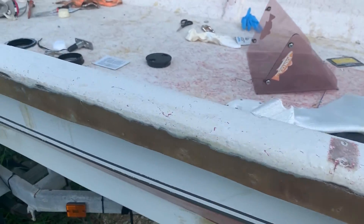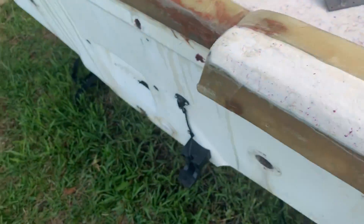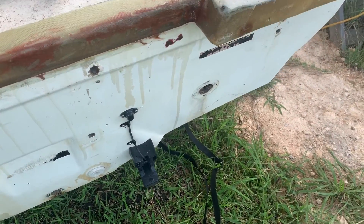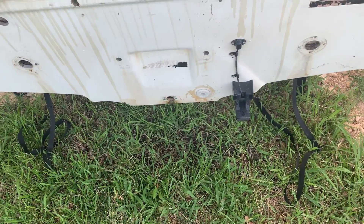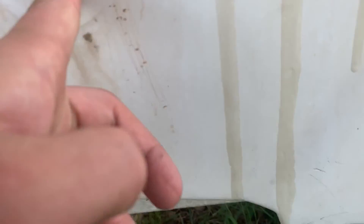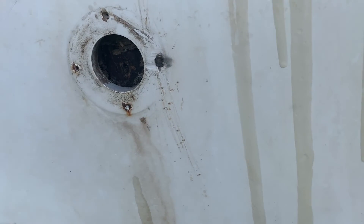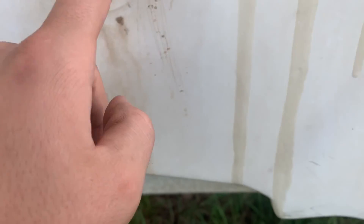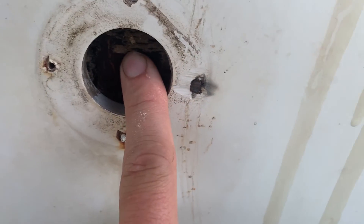I really really like this boat, so that's looking pretty good. Gonna have to figure out if my jack plate fits and lines up with these holes. If it doesn't, that's not a big deal — I'll make new holes. Had one issue though: the last guy who tried to rebuild this boat did a horrible job. He tried to make self-bailing scupper holes but didn't drill them all the way through. The fact that this transom isn't rotten is amazing.